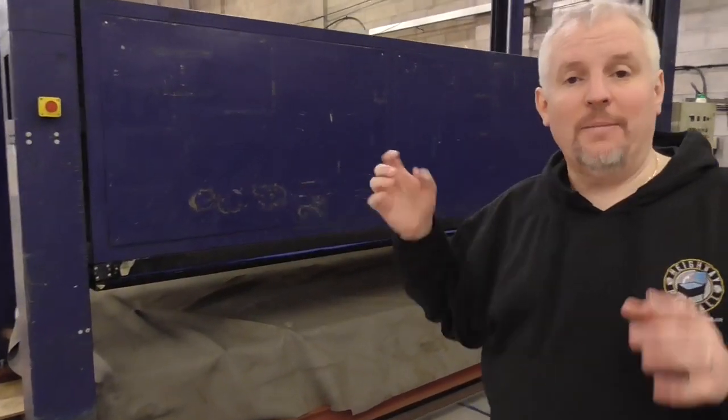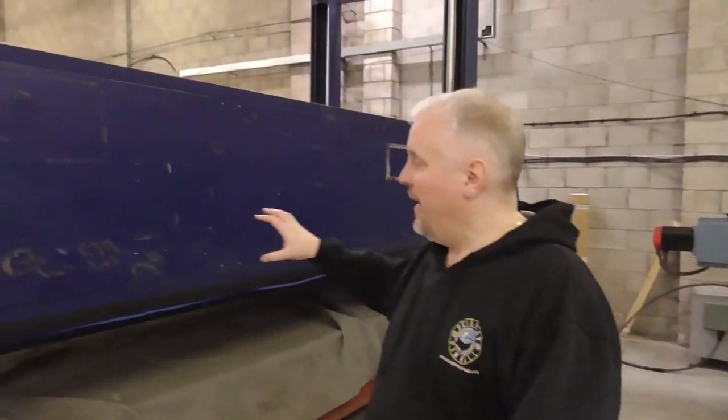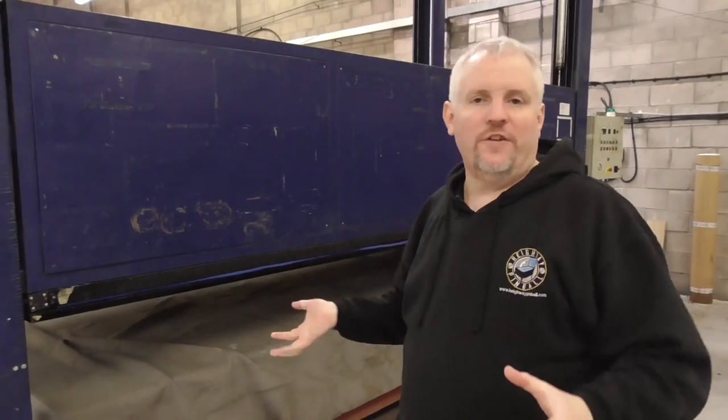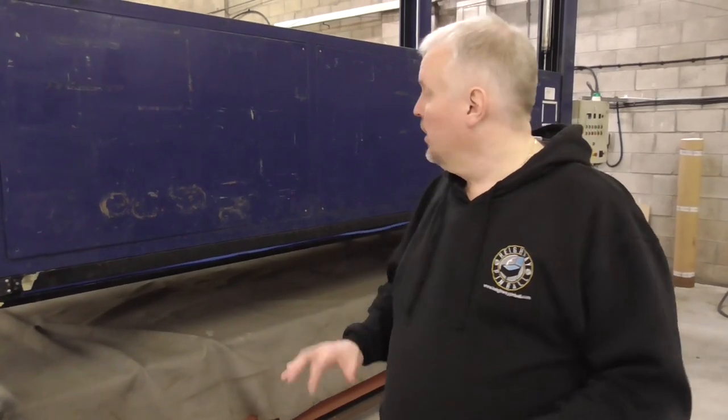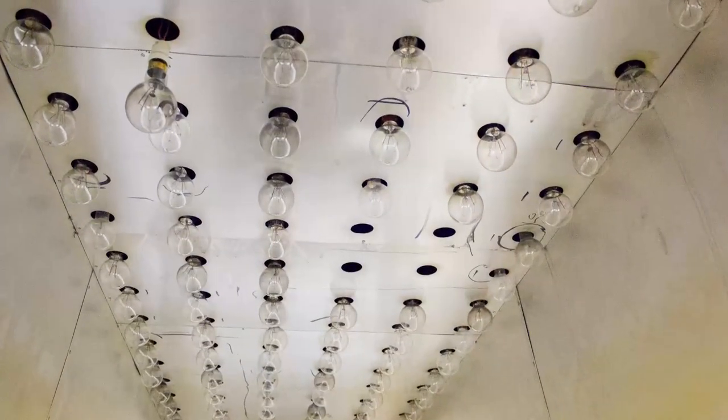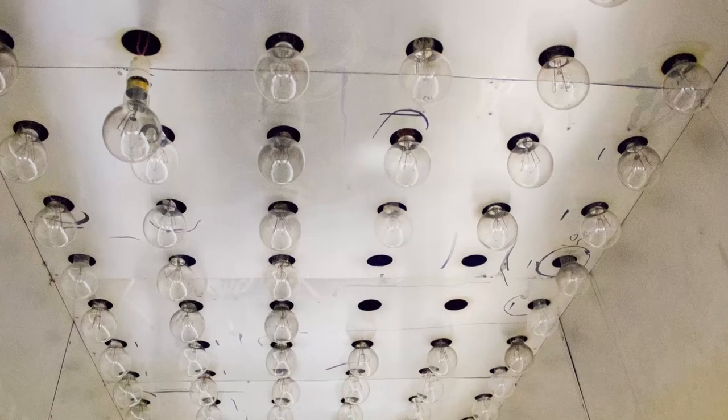What this does is it takes the MDF panels which are cut on the CNC machine here and then wraps them with a surface coating — so it can be a gloss black, a gloss red, it can be a matte black, depending on the edition of the game that we do. This particular machine in the past has made kitchen panels, the inside panels on aircraft or trains, and this now is going to be making the outer panels for Highway Pinball games.